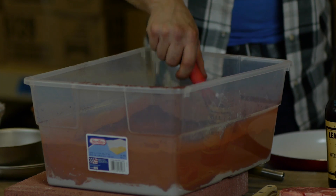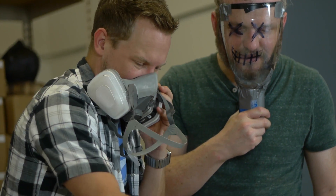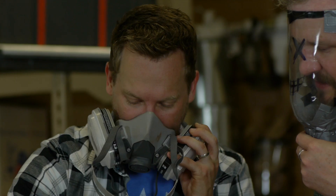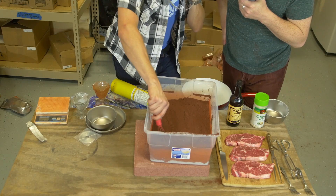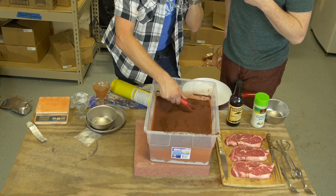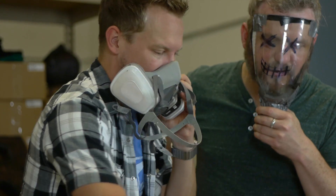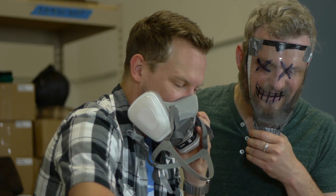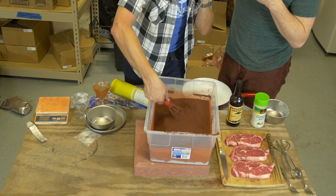The idea is once the reaction's hot enough, it begins to self-oxidize as it bonds the elements together. But the problem is how do you stop it once it starts? Most of the time when you use a fire extinguisher, it robs it of oxygen and stops the flame. But since thermite has its own oxygen, it won't stop. You can possibly cool everything down enough that the reaction stops happening. Because this is extremely stable — it's very difficult to get started, but once it gets started, it's very difficult to stop.